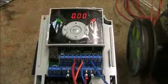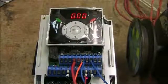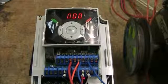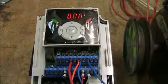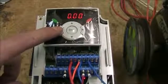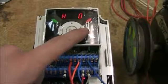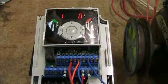The basic LED is only a one line display. There are 4 main parameter groups: your drive group which is your basic parameters, function group 1 which adjusts output frequency and voltage type things, function group 2 which has more advanced features, and your IO group which deals with all your inputs and outputs. The 4 arrow keypad makes it easy to navigate. Using the right arrow key you can get to all 4 function groups — function group 1 is labeled F, function group 2 is labeled H, and the IO group is labeled I.